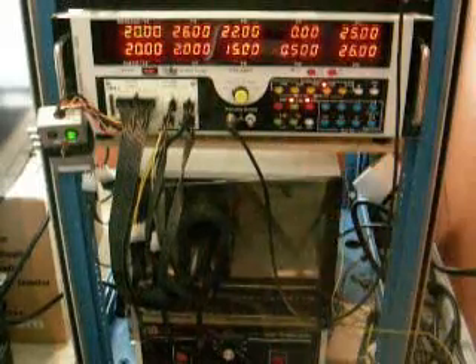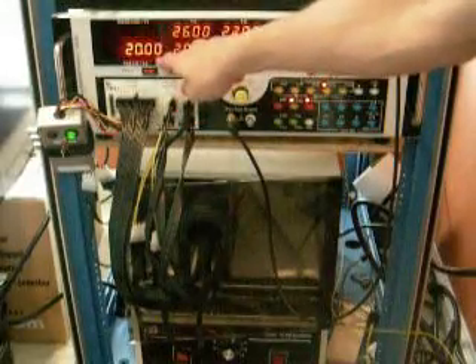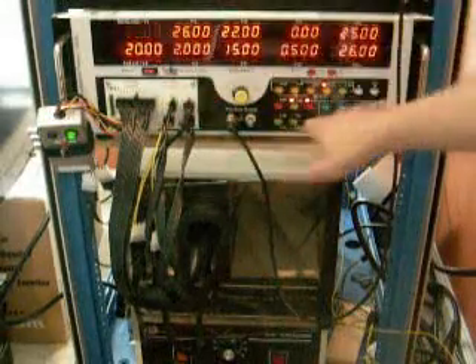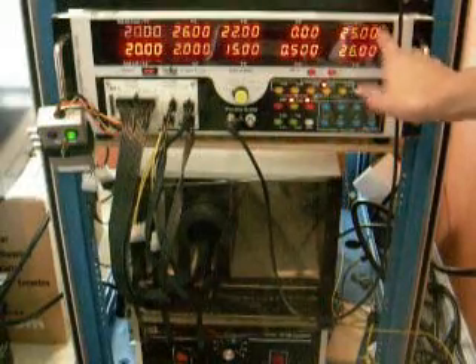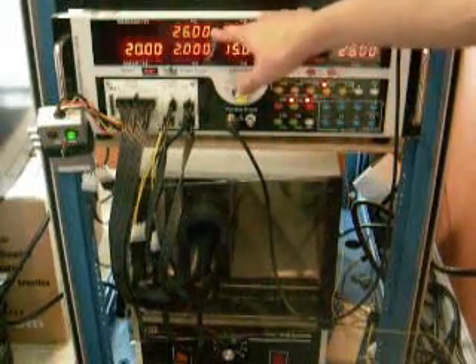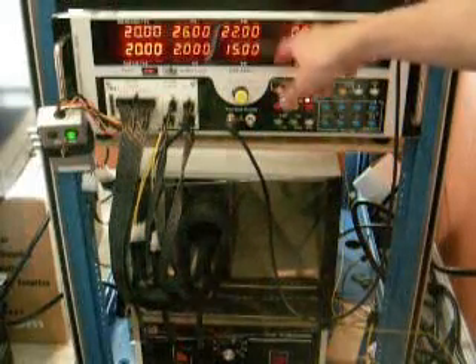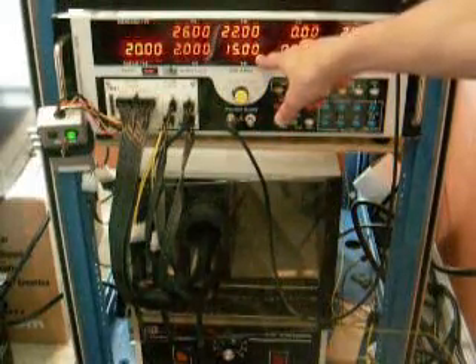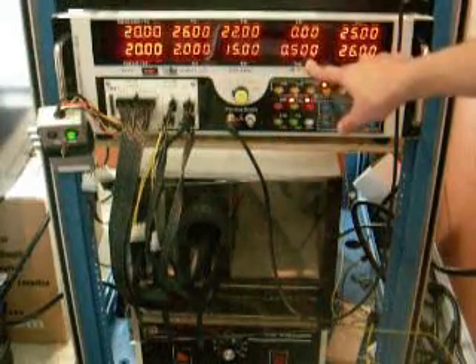The way we've loaded this today is 117 amps on the 12 volt rail. We do this with 20 amps on one PCI Express connector, 20 amps on another PCI Express connector, 26 amps on a third, 25 amps on the P4 AUX, and 26 amps on the ATX connector. Additionally, we have 22 amps on the 5 volt rail, 15 amps on the 3.3 volt rail, 2 amps on the plus 5 USB, and 0.5 amps on the minus 12 volt rail.